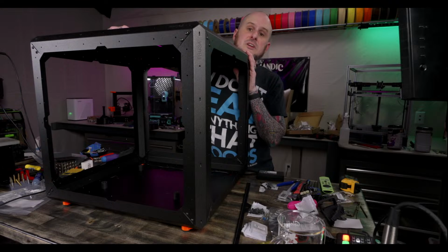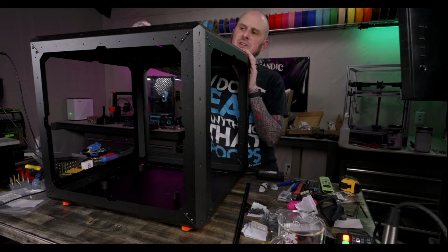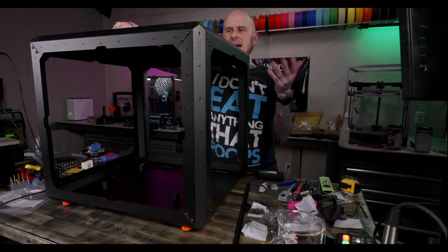Actually, dynamic overhang doesn't help with that. Exactly. I need to slow down layer times entirely for that section. Dynamic overhang helped on the earlier part where there was enough layer time. I need to slow down layer times. That was a bad setting choice on my part.